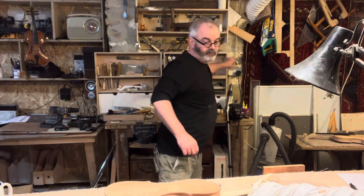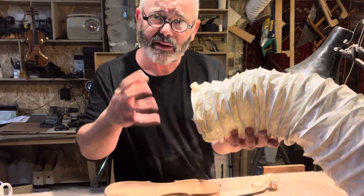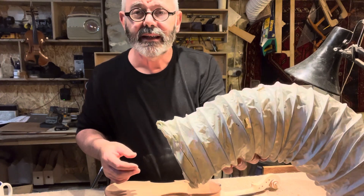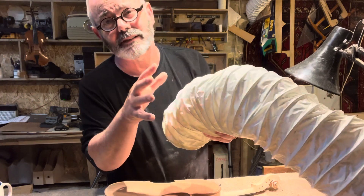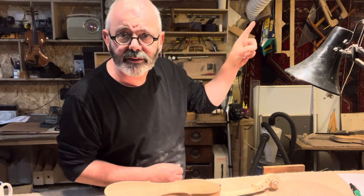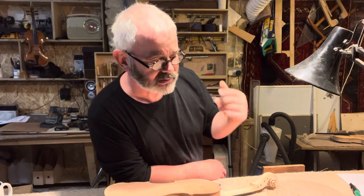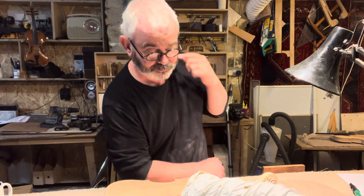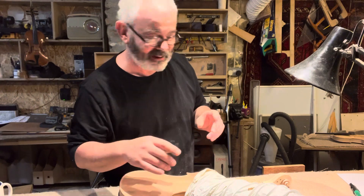Because it produces a lot of dust, the other power thing I use in the workshop a lot — for hand sanding operations and all sorts — is just a bit of cheap bathroom extractor fan ducting. I've got that going out through an old window with an inline fan in it, and I just leave that on so I can bring it close to where I'm working. You can see dust in the air just disappearing, which is great.